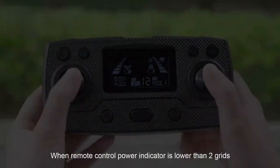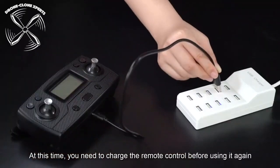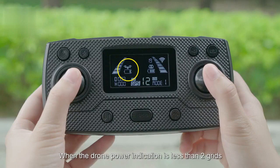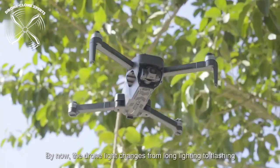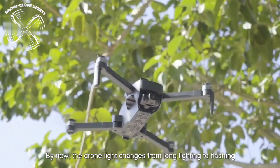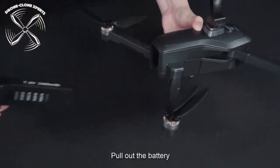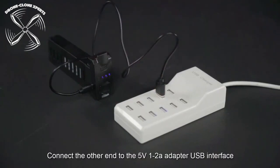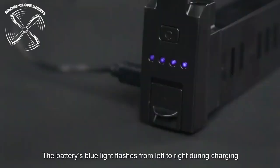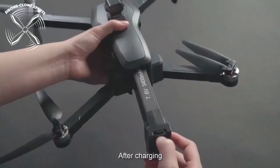Battery replacement and charging. The battery of the remote control lasts a very long time, but you can monitor its progress on the display. The same type of cord is used to charge both the remote and the drone battery. Your remote also tells you how much battery your drone has left. If your drone reaches critically low battery, its autonomous return-to-home failsafe kicks in. When this happens: 1. You won't be able to cancel return to home because it needs that remaining power to get back safely — this is done to protect you, the craft, and any bystanders. 2. The obstacle avoidance feature isn't active during this time, to conserve enough battery for the drone to make it home. 3. Most importantly, when return to home is activated, the drone immediately climbs to about 70 feet before beginning its journey back — so don't be under anything when flying with low power.